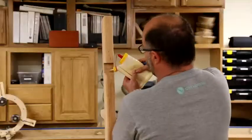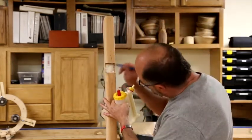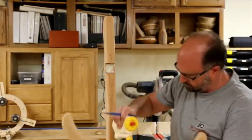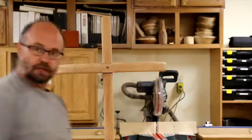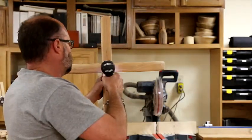After at least 24 hours for the epoxy, I'm now gluing on the arm units, getting a good coating of glue on all the mating surfaces of these half-laps. The arms themselves were pre-drilled for screws that you're going to see me put in, and I made plugs out of matching cherry material. When I go to put those plugs in after the screws are in place, it's important to pay attention and try to match the grain direction of those plugs so that once they're sawn down flush and then sanded over, they very nearly disappear into the remainder of the work.